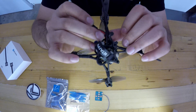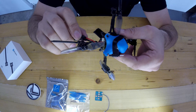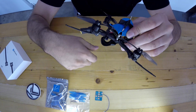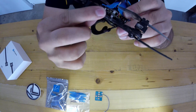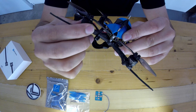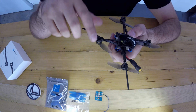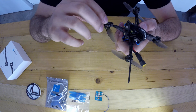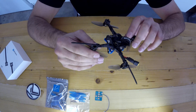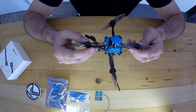The other little modification I did was cable-tie the battery strap to the arm, because the way it comes out of the box the battery leads come straight off the FC — that's never good when you eject a battery. You never want to tug straight onto your flight controller, so I added a little cable tie to relieve the pressure when you crash and the battery ejects. The two receiver antennas were also just flapping around, so I did a little cable tie and heat shrink to protect them. It adds a little weight, but I feel it's a lot more protected and will last a lot longer.